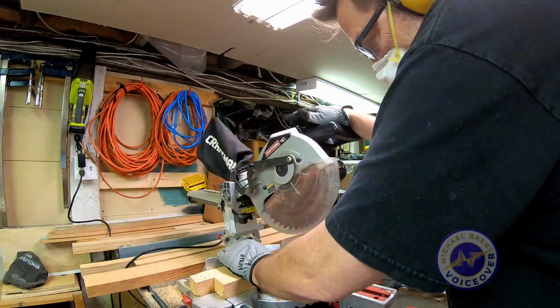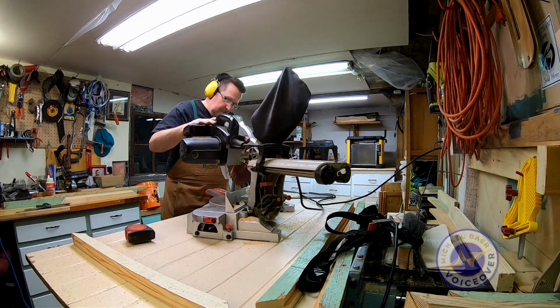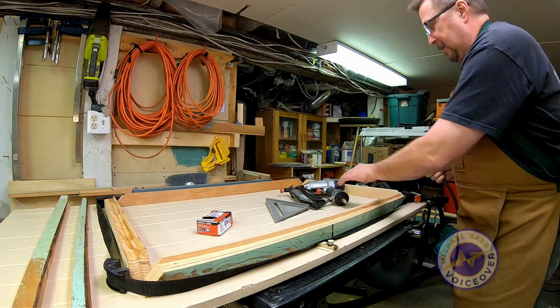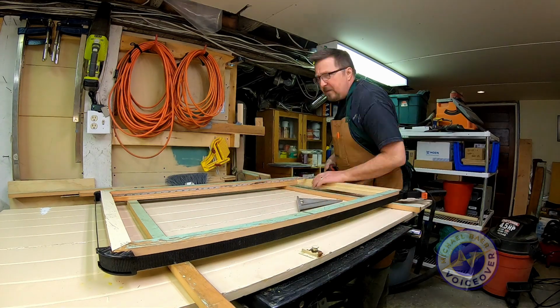So I'm just in a holding pattern. I've glued my first window up and I've clamped it up with my strapping clamps. I'm going to give it 20 minutes or so. Then I'm going to take the clamps off and drive more than a couple of 2-inch 16-gauge brad nails, just pinning the corners, to give it a little bit more strength perhaps. It's square.